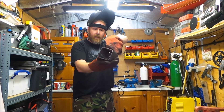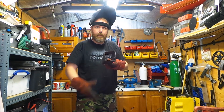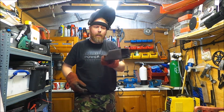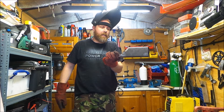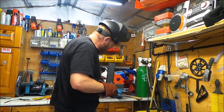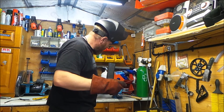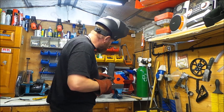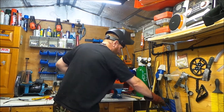There you go — I've just welded the plate in there, it's still warm. I've moved the plate in and out, but I've welded it now because when I put the funnel on I'll be in trouble if I don't get it right. Next job is to roll the top on. For some reason I didn't have the right angle on the cutter, so it's a little bit off 90 degrees, but for what I'm doing it's not commercial so it'll do for me at the moment.